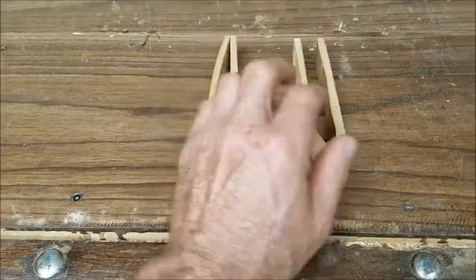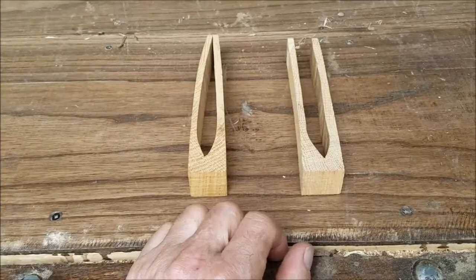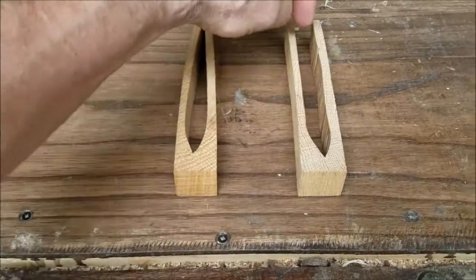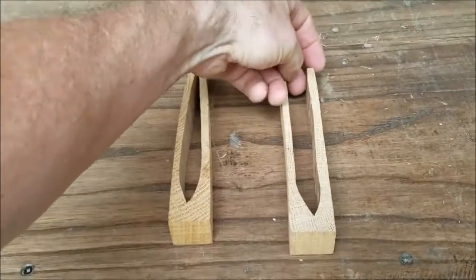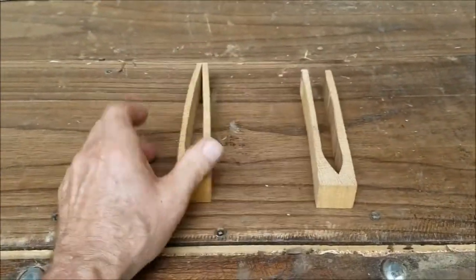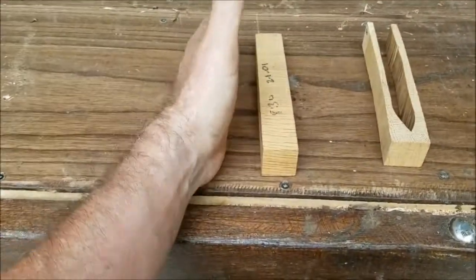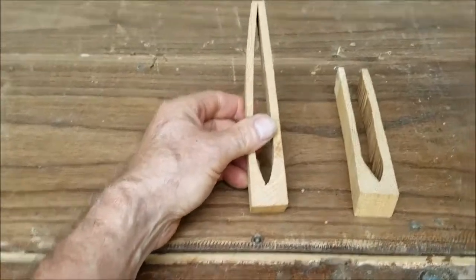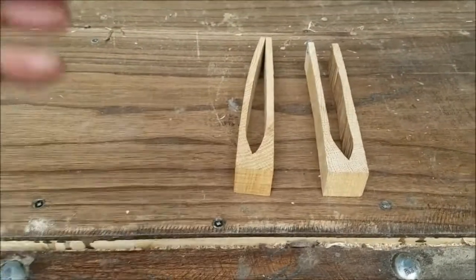By the conditioning process, when you're introducing high-temperature steam at large volume to saturate the outer fibers of the board, in my kiln with my size load it takes about 30 minutes. Then I cut a sample board at the band saw and it comes out even — that's what you want. If I kept introducing steam for longer, it would be reverse case hardened and would flare out. I've never had that happen because I watch it closely, but if it flares out you can't fix that. Anyone who's put a board on their miter saw and had it clamp down on the blade — that's primarily caused by internal stresses in the board from how it dried.